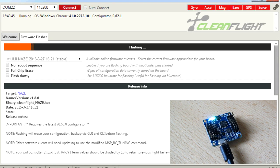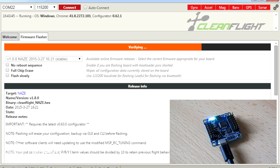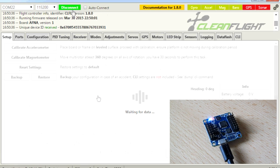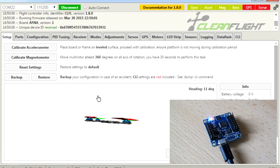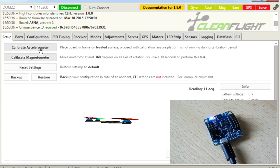And there it goes — all three lights are lit now: the blue, the red and the green. It's hard for the camera to pick up with the LEDs being so bright but they're all absolutely on solid. Now verifying the load... programming successful. She's rebooted. We click connect, and now as I move the board around you can see it moving on the screen. We can see up in the right hand side that we're running the 10 DOF version — not only are the gyroscopes and accelerometers showing, but the magnetometer and barometer are showing perfectly as well.